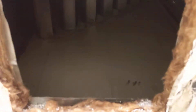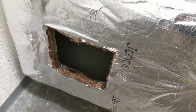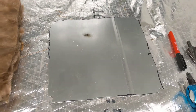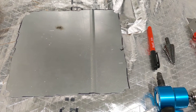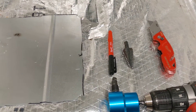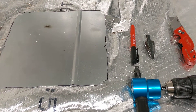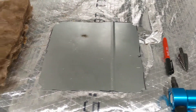More dust and dirt buildup. Once the insulation's been cut and the ductwork itself has been cut with either nibblers or electric shears, this is the sheet metal piece that comes out. All we do is mark the square — we measure what size door we're going to use, mark it with a marker, then use a unibit or step bit to drill a hole in the corner of where we're going to cut, and then use nibblers or electric shears to go around and cut the perimeter of the door itself.